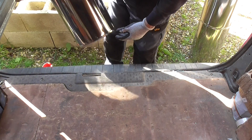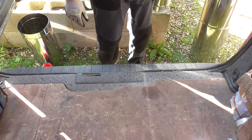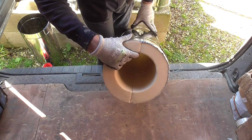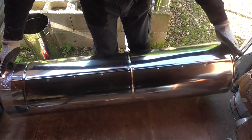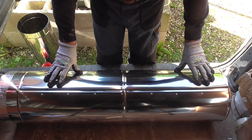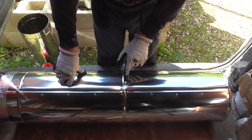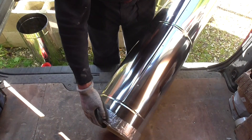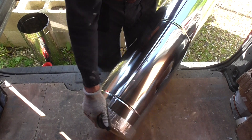I have actually installed some casing on a piece of six inch section — you can see that from the camera shot — by 50mm wall. So here is our installed casing. What we've got here is our male swage, followed by male and female swages running along, with our final female swage ready to take the next piece.